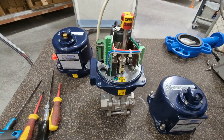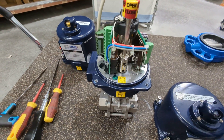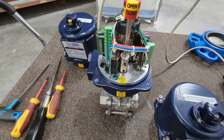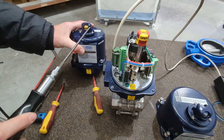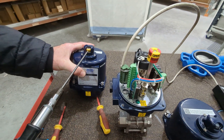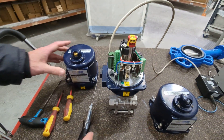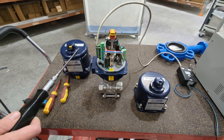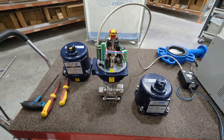There are two extra limit switches on there that give you a voltage-free feedback signal, so it doesn't have to be your control voltage. The visual indicator shows two different segments — open and close — so it tells you visually whether it's open or closed. It's a very reliable, industrial-grade electric actuator; we supply a lot of these and don't get any issues.